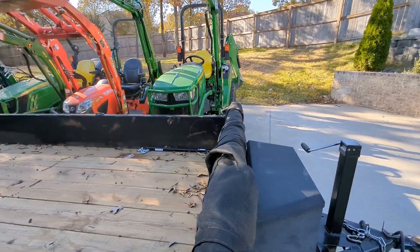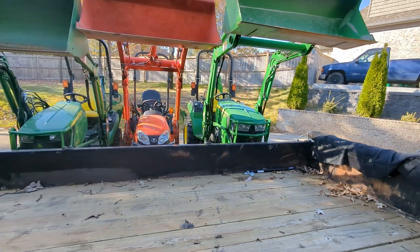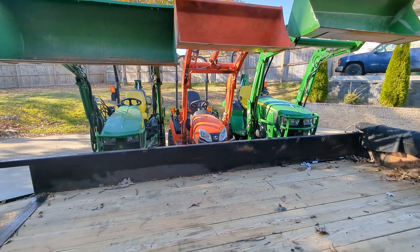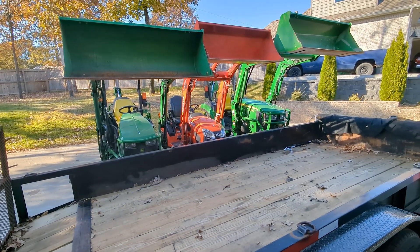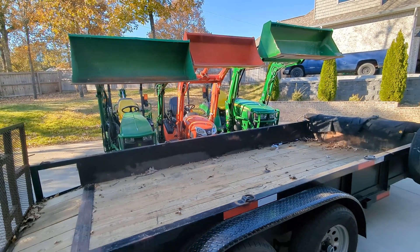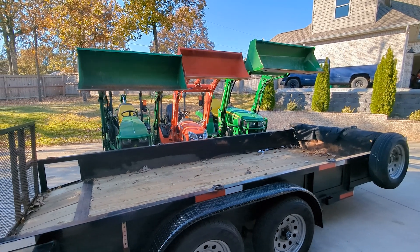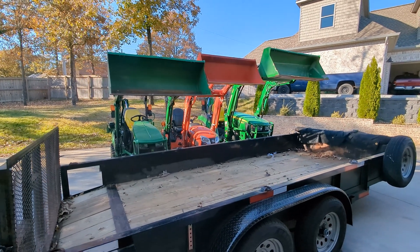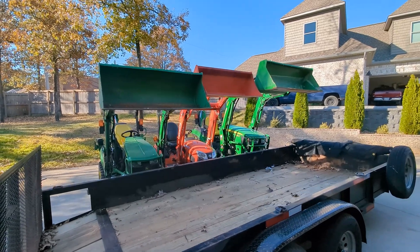I said 85 and a half — I think John Deere listed it at 85 inches to the pin, which was a little generous based on my actual real-world measurement. That tractor actually has two factory sets of tires on it, so if you've got the bigger tires like the R4s, you're going to get different measurements both on the pin height and how far you can go down. When you have the nicer radial tires and don't have the bucket on, you can't touch the loader arms to the ground — they're off the ground about a couple of inches.